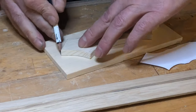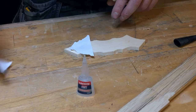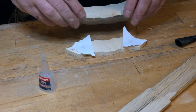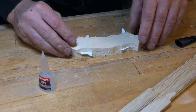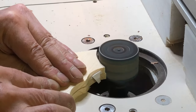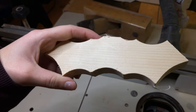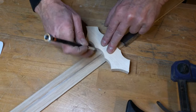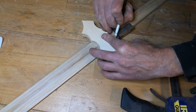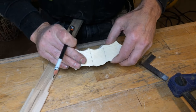We're going to make one more piece, and after it's cut out we're going to temporarily glue the two pieces together with some CA glue. Put two pieces of paper between them so it's easier to separate them later. We're going to make the two pieces identical with help from a circular sander with an 80 grit belt. Lay the crossguard on the sword and trace the outline. You're also going to mark the width of the sword on the crossguard, because we're going to cut some of it off so the crossguard can be laid on top of the sword, with the two pieces connected on each side.